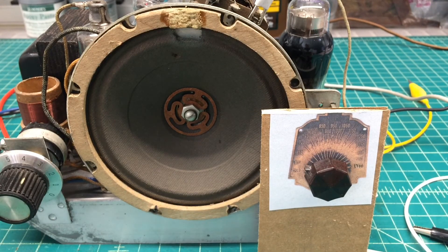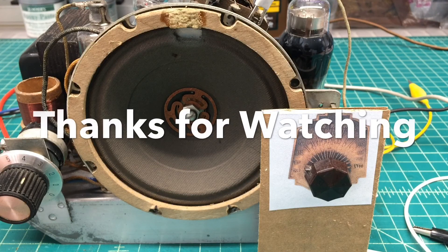Thanks for watching. I hope you found it informative and helpful. I think it just points out the difference in tone controls and how capacitors are used to shunt those higher frequencies to ground and act as a nice filter. It appears on the surface that you're increasing the bass, but you're just shunting the higher frequencies and allowing more of the lower frequency part of the spectrum to pass through to the little loudspeaker. I appreciate you guys following along.